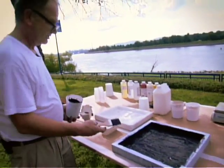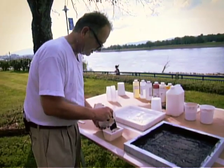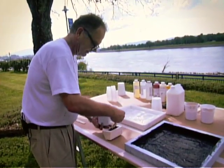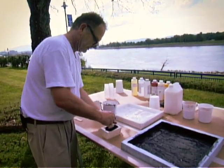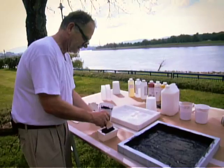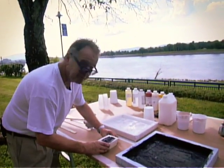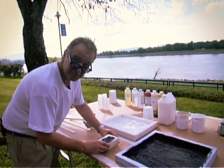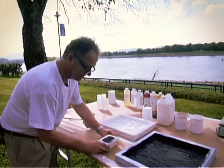As we have some material to spare, we have a small mold to hand and we will cast this little object. Again, make sure that you've got good surface contact and then fill. It is often helpful for a casting, if possible, to shake the mold so that any entrapped air will be released.